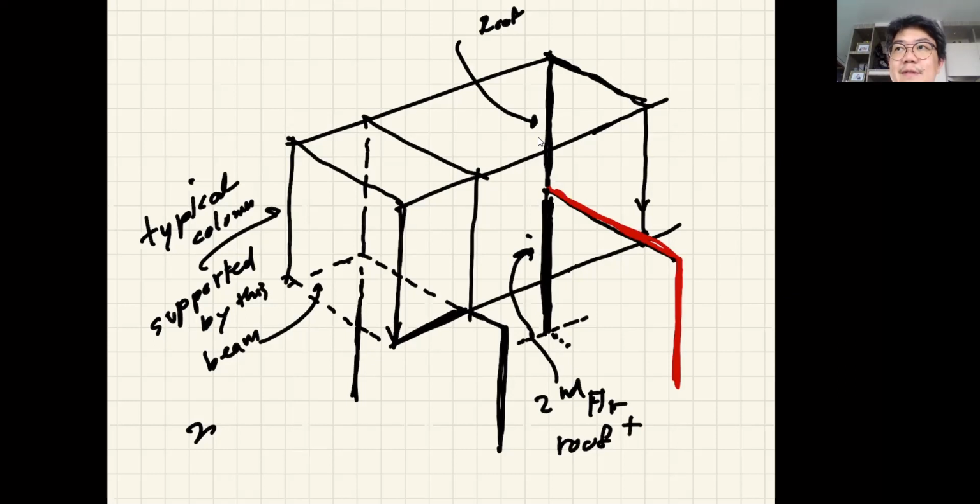Okay, and this is the general case that you should know. Let's say in your house, the garage: generally people would try to save money by not putting the garage on the structure of the house, to reduce the weight of the foundation. If you do that, your garage will crack, because the floor of the garage will sink so rapidly because of the soil condition in Bangkok.